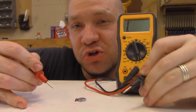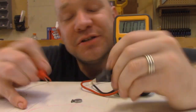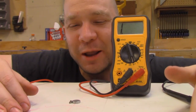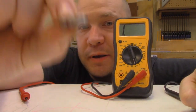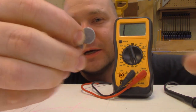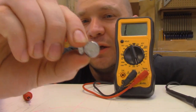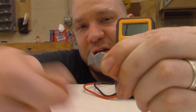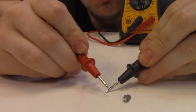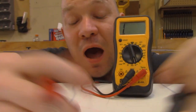Most of that first test really came down to a check of whether our magnets were properly conductive. It worked pretty well for a couple of iterations, but in bouncing up and down inside of its little nest, they tended to break. Little pieces break off of them because though these magnets are very, very strong, they're also pretty fragile. A piece is going to break off and it's either going to be unable to make the connection because it's broken in half, or this little guy is going to just sit there between its two leads making a perpetual crappy connection — either way it breaks the game.